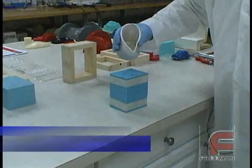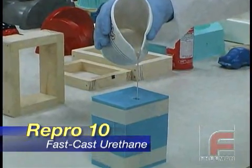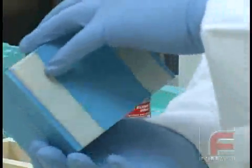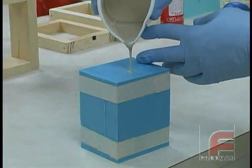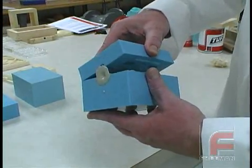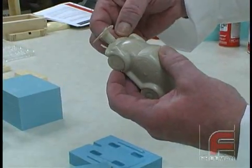This is our Repro10 tan, which has been agitated, weighed, and mixed. Because of its low viscosity, Repro10 pours very well. To make sure that we have no air bubbles on the surface of the mold, which might naturally occur around the headlights or other detailed parts of the model, we pour in a little material and then rotate the mold to make sure the entire surface is covered first, and then we finish filling the mold. About 30 minutes later, our Repro has partially cured but is still a little rubbery. We wanted to demold the part now so it is easier to remove the gating system. After removing the tape, we separate the two halves of the mold to reveal our new model. A little material did flow up into the vents, but notice that there is no air entrapment in the casting itself.